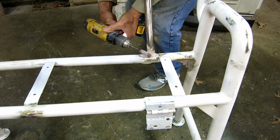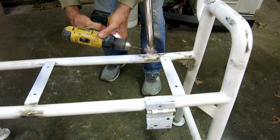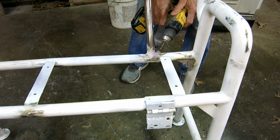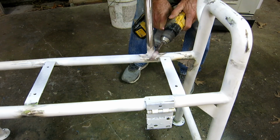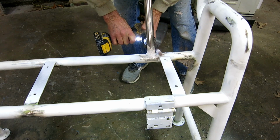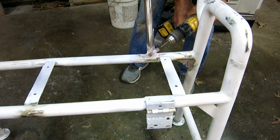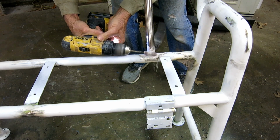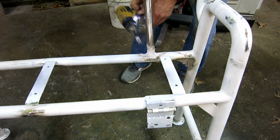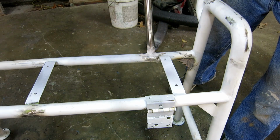This is a Harbor Freight tool that I'm kind of fond of. It's a little steel mandrel. It basically has screw threads on the end, and it comes with a pack of sandpapers rolled up in a little roll, like a little tight roll of paper towels. And as you use it, it kind of wears out. And the darn things work pretty good. I use them a lot at the foundry with a high-speed grinder, but it does okay with a drill motor also.